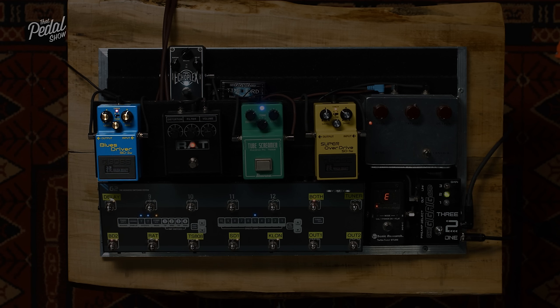So two things there. You'll notice that when I had the volume all the way down, it sounded quite dark. As I turned it up, we started to hear what was happening in the feedback loop, because in that feedback loop, we also have EQ filters, shaping the sound of the distortion. But the other thing that happened is as I turned the drive up, it was getting louder, so I had to compensate with the volume on the left-hand side. However, as soon as it starts to clip, I've hit the rails. So from then on, when I turn up, it's more distortion, but I'm not getting more volume.